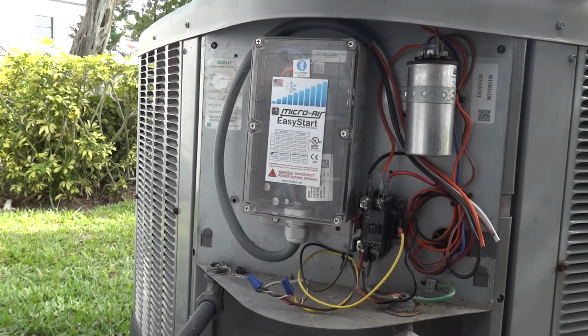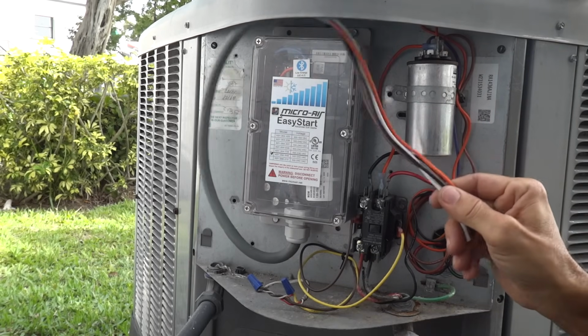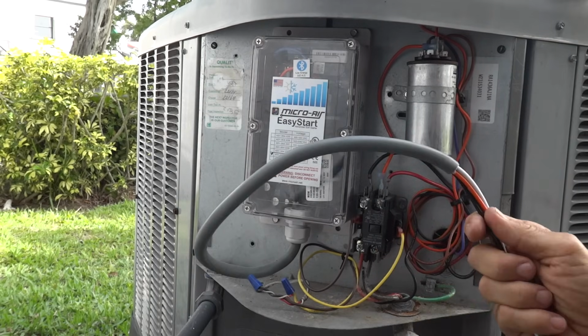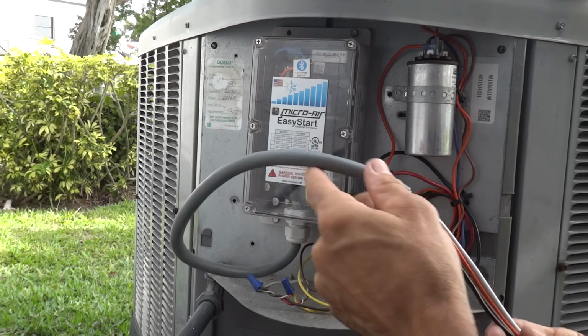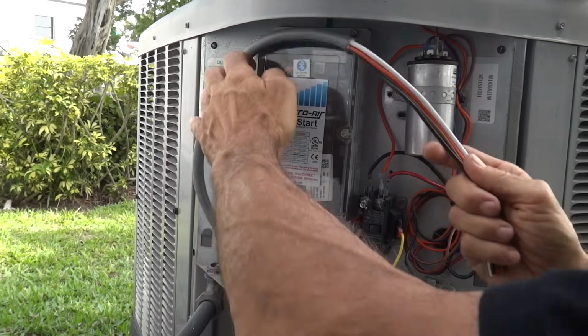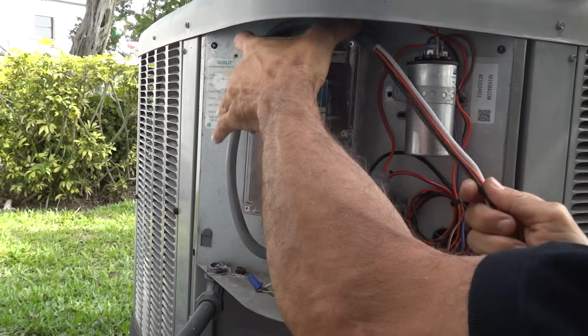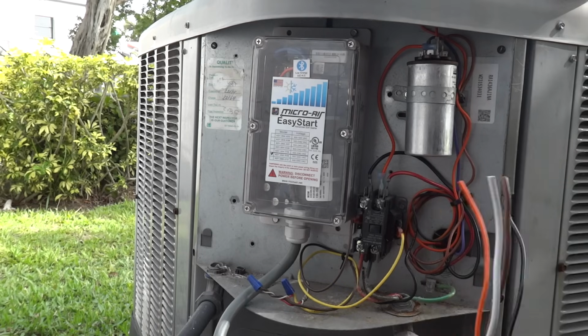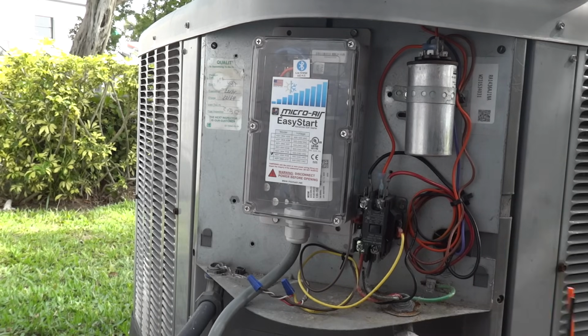We're ready to start the wiring now. And in this case, I've already cut back this harness to be much shorter than it normally is. This harness is typically 32 inches long, so you've got plenty of harness even if you mounted this outside. But in this case, I didn't need all that extra wire, so I cut it and stripped it back. So we have 4 connections here that are going to be very easy, and I'm going to go through them now, and then we'll speed up as I do the stripping and crimping so that you don't have to wait for me to get that done.